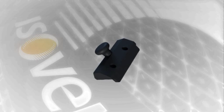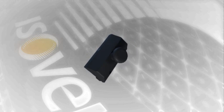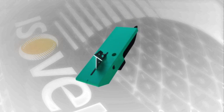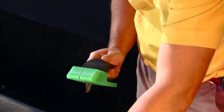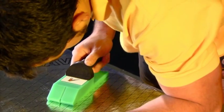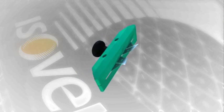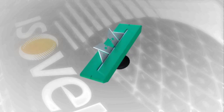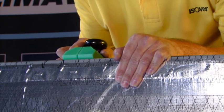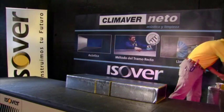The black label tool makes shiplap edges to enable the union of single pieces or assemblies. The white label tool has a set of blades at an angle of 90 degrees as regards the surface to be cut; it is used to cut straight ducts for transformation into duct assemblies, following the guidelines on the outside of the KlimaVair. The yellow label tool has a set of blades set at an angle of 22.5 degrees as regards the vertical, and is used to cut straight ducts for transformation into duct assemblies, following the guidelines on the outside of KlimaVair.